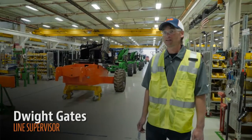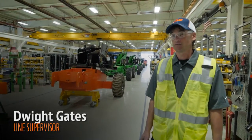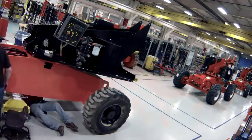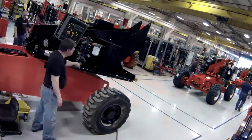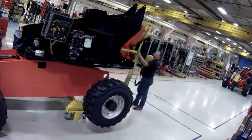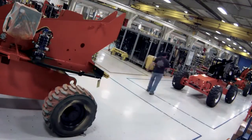When a machine comes to Station 1 on the reconditioning line, it takes approximately three days until the machine is green-tagged and ready to ship. Something we do between each station to ensure quality is we have history logbooks that go with the machine. Each station has a set workload that they do, and we also follow the same quality criteria as new production to do reconditioning.